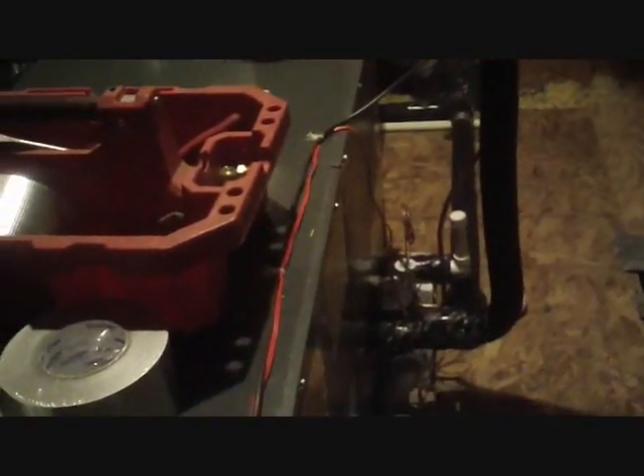All the trunk duct is in, running all the way back to the ASPF Goodman air handler. It actually runs underneath because there's enough room now. I'm doing the run-outs on this side — I already did the ones on the back, but I didn't want to do the front ones since they'd be in the way of carrying the trunk duct in. We turned the AC on so a little cold air is coming through. I'm tying in those runs and we should have better airflow in the house with a little less duct loss.